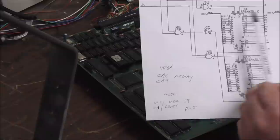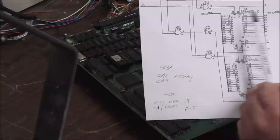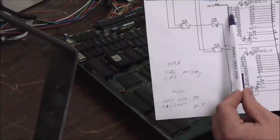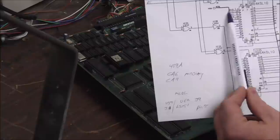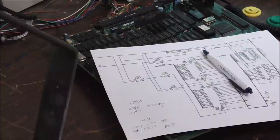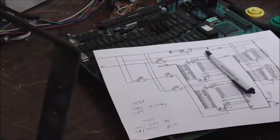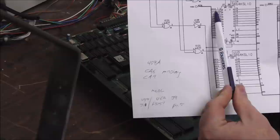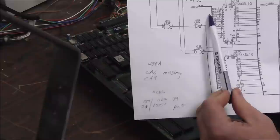These RAM chips get signals called CA1 through CA13 — the address lines, I guess. What I was getting was the top two address lines, 12 and 13, were both low. Now, I never went to school for this and I don't completely understand how it works. But I believe sometimes you get a situation where all of your address lines pulse, but the top couple might not — because it seems like the higher up you get, the less they use it. So maybe some of the program doesn't use the top address lines. These top two being low, I don't think it's a problem — I just don't know for sure.